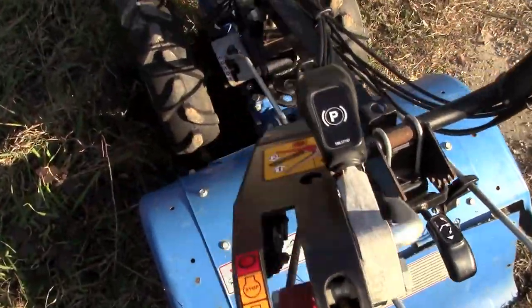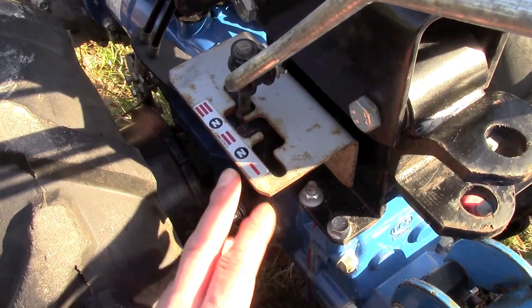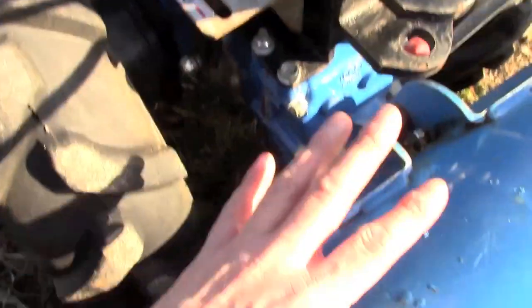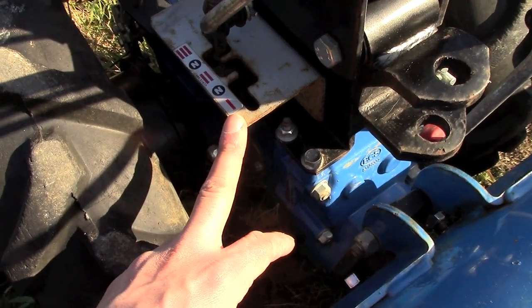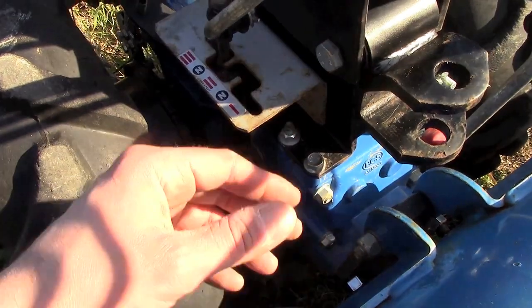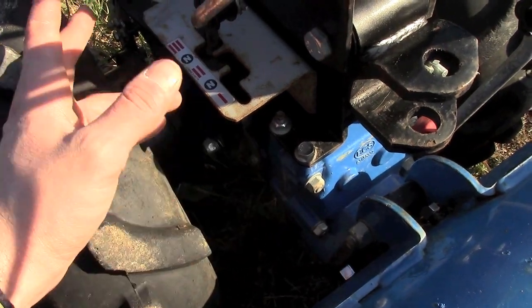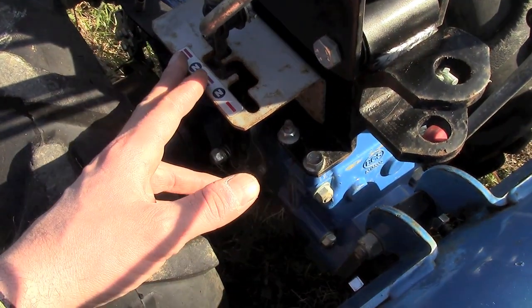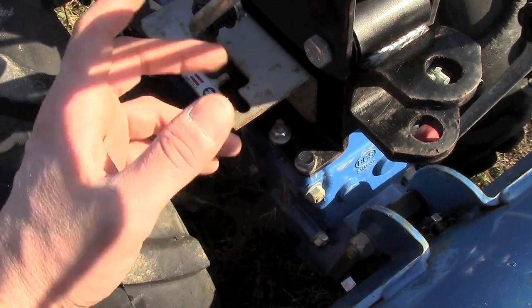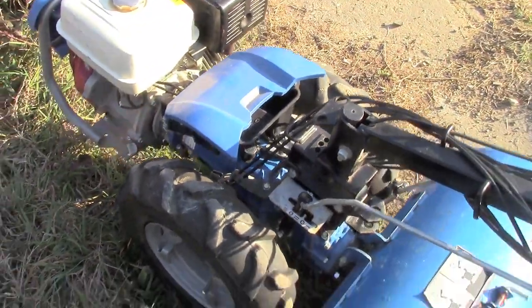We have three gears: first, second, and third. If you want to move through the field slowly but move your tool fast, you can put the RPMs up and put it in first — great for getting a nice fine tilth on your soil with the tiller or another power implement. Third gear is good if you've got to get across the field fast without power, and you can also till sometimes really fast. If you have a quick pass to make to control some weeds and it's not a serious weed issue, you can do it in third with the RPMs brought down.